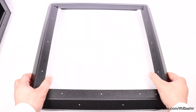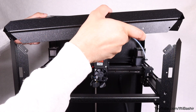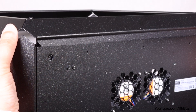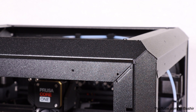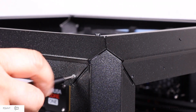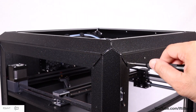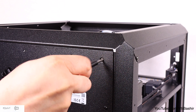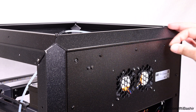The top of the frame is now complete. The rear profile side with two openings needs to sit on the rear of the printer, so lower the frame down into position. The rear profile's protruding lip slides in behind the rear panel, while on all corners the top frame covers the tabs with threaded openings. Secure into place with two M3x4 black screws in every corner, making your way around the entire frame and ensuring tabs are underneath each edge profile. Finish by inserting three nylon rivets across the top of the back panel.